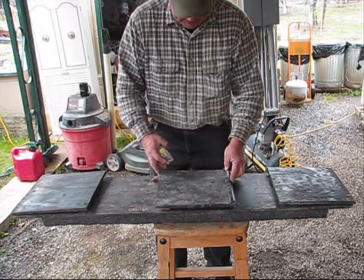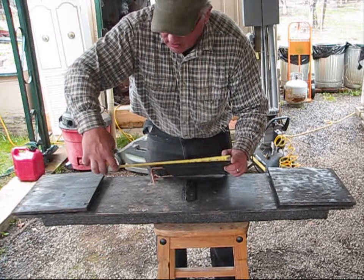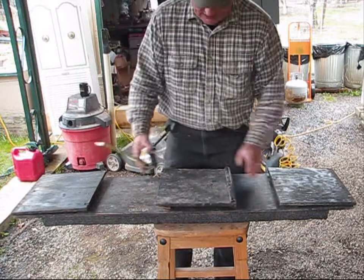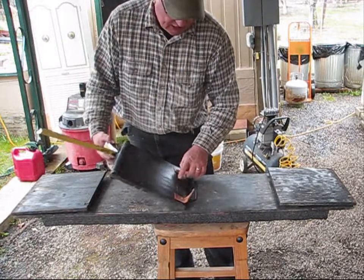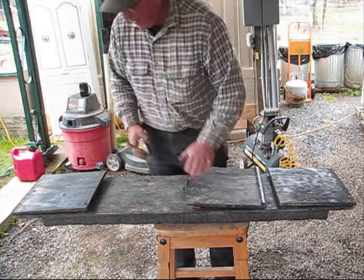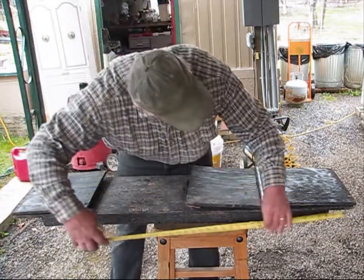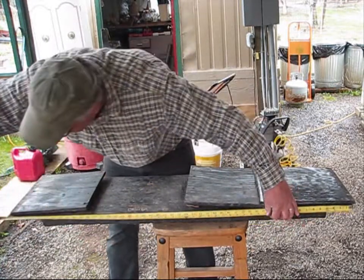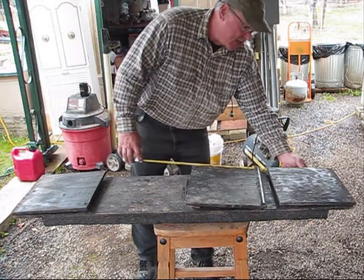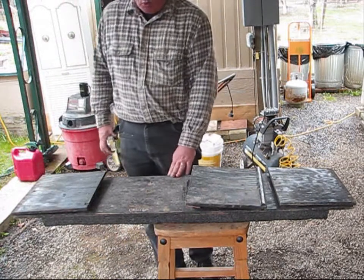The centerpiece is, of course, 1 foot, and it measures 11 1/4 inches. The whole seat, you see, I need to replace the hinge right here. I think I can get away with just a simple piano hinge or something. So, the actual seat, this is the center, one side measures 49 1/4 inches, and the other side measures 49 1/4 inches. So this one is square.